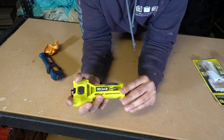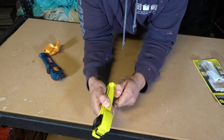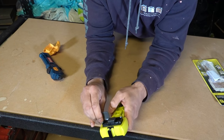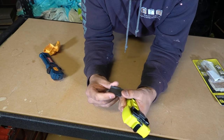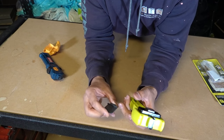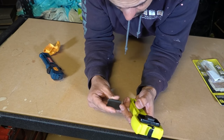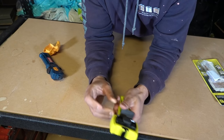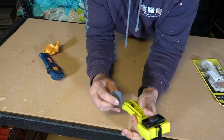I've personally never used it on the other one and I've lost both of them, so they're handy if you want to use them but I personally don't. We've got our little fence here on the side. It's got two different rebate positions — 35mm and 40mm, and also 45mm thickness which is not that common. 35mm is probably your standard internal doors, 40mm is for your external doors. Simply slot it in place, stick it up against the door and then you can tap it in place. We'll test this out in a second and see how well it works.